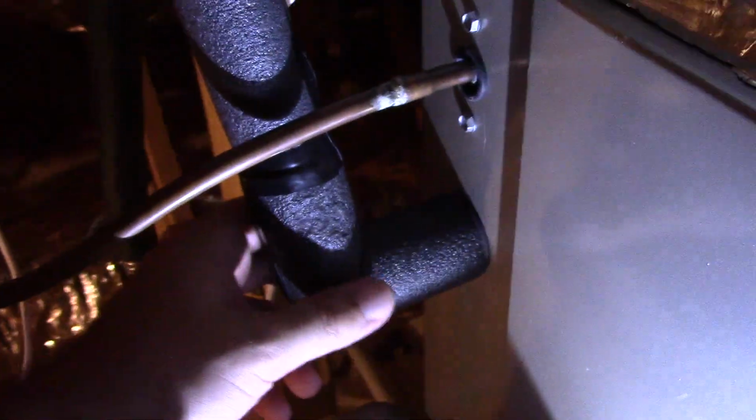So now when the air conditioning operates, it's fantastic. No more sweating, everything is dry, just the way it should be. So I'm very glad that I fixed that. You don't want to have water damage over time. And really, just the fact that the zone damper is opening fully now, once again, if I can show you, you can see the green LED is on, which means that it successfully opened all the way, which is good to see.